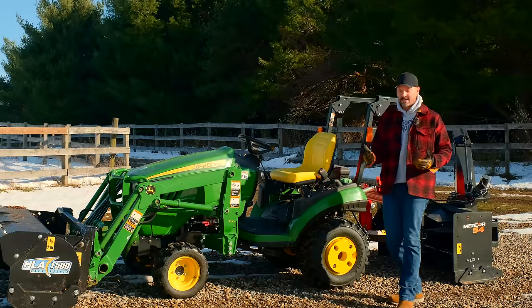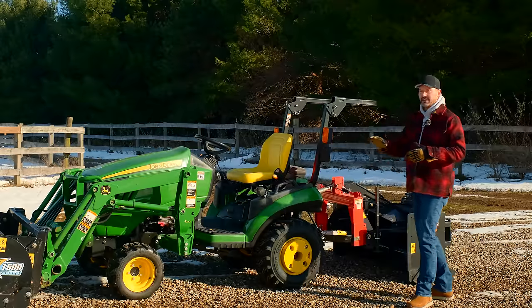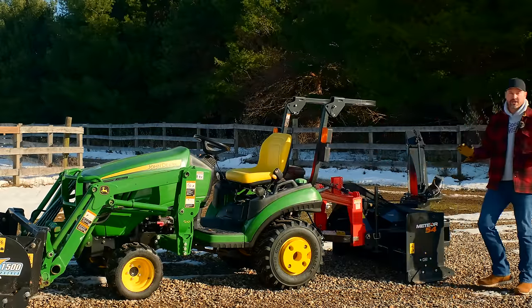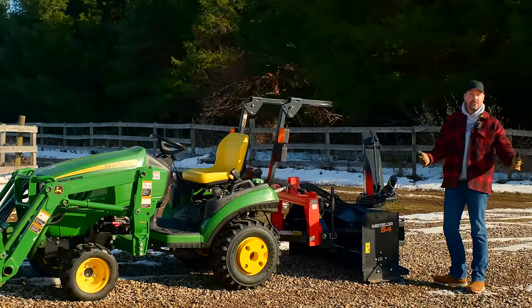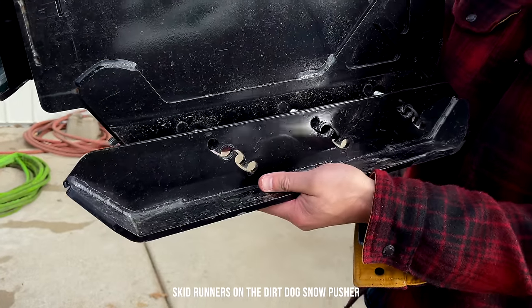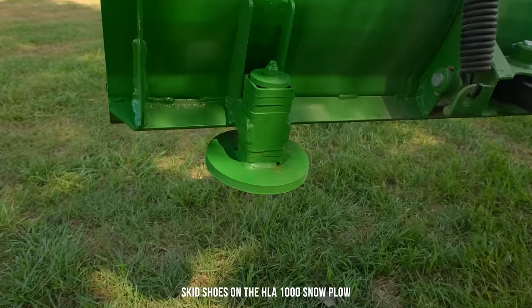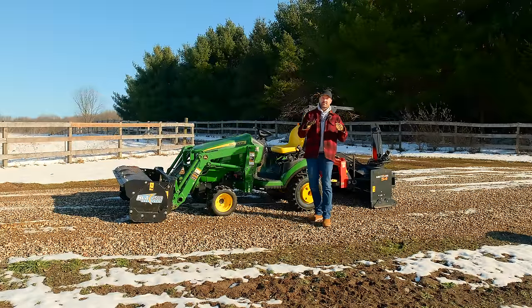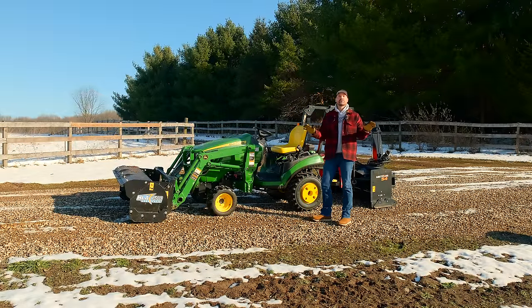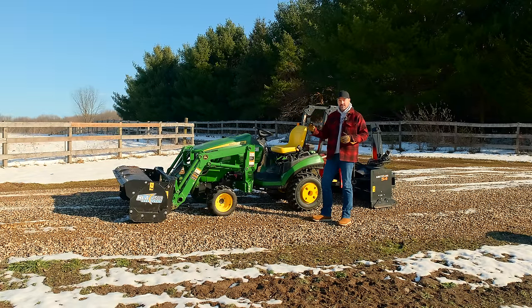Let's take you through everything you've got to pay attention to. Gravel driveways are great — they're very aesthetically pleasing, but they come with some challenges. The first thing you want to do, it doesn't matter what kind of equipment it is — it could be a snow pusher, a snow blower, a snow plow — but you need to have skid runners or skid shoes on a plow. Something that allows you to get that main cutting edge up above the gravel. There are certain pieces of equipment that don't have those adjustments, and I would rule those out right out of the gate, because you never know what you're going to need or what kind of surface you want to clear — maybe you go from gravel to a paved surface down the line. You need to have that adjustment built in.